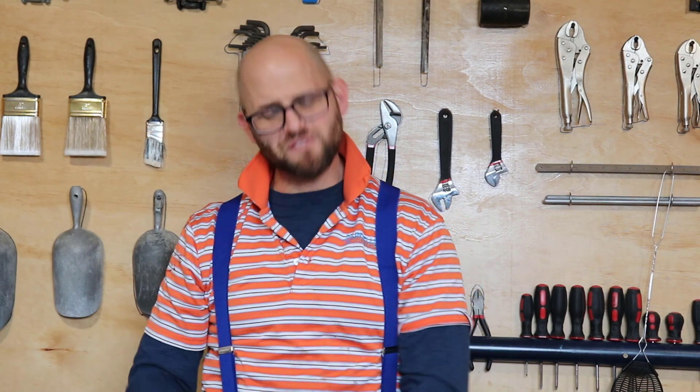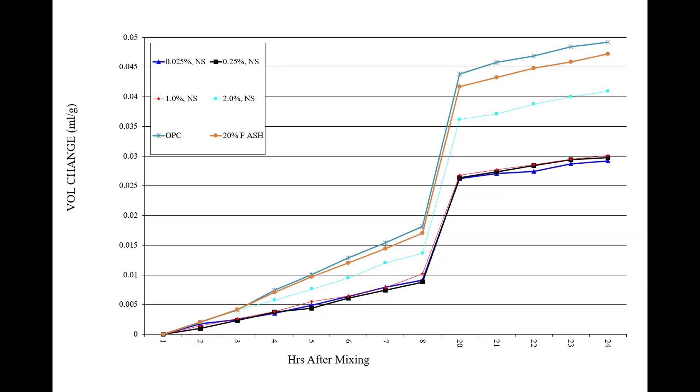Interesting stuff — one of my favorite ASTMs. I have these charts set up to show you what it's like. So, going from memory: you have your surface, which is the sacrificial layer — normally a high peak as you cut through that — and then you start climbing to a plateau in your subsurface, then you get into the body of your concrete. Ultimately, we want to reach a plateau as soon as possible. The sooner we can densify, lock in our aggregate, and the harder the aggregate we use, the more work hardening and polishing we're going to get.